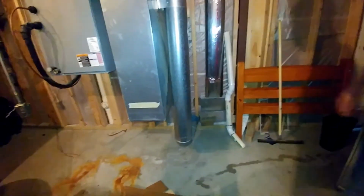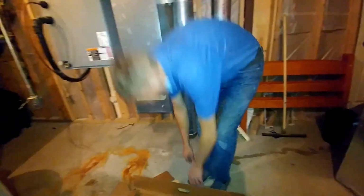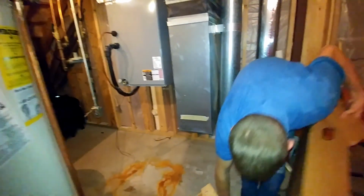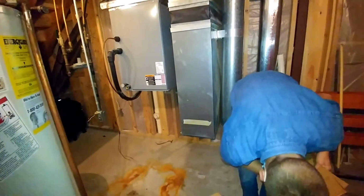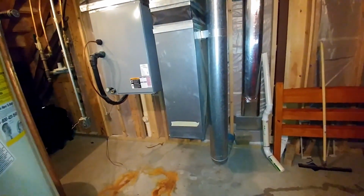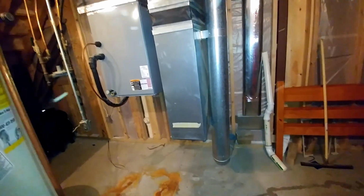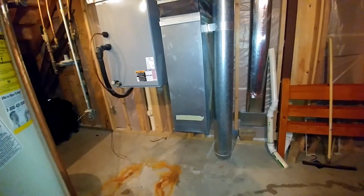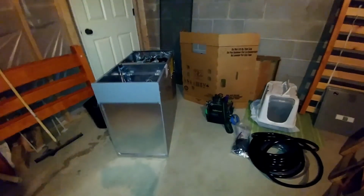That was when I decided that every furnace over 60,000, and even smaller furnaces where the homeowner wants a 4-inch filter, gets a base underneath it with a 20 by 25 filter. And that's probably going to play true for all brands. The limit faults we're seeing in today's world with these newer furnaces is just crazy. So airflow is the key.